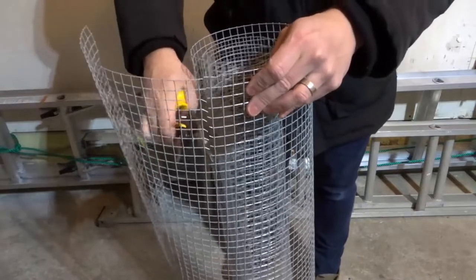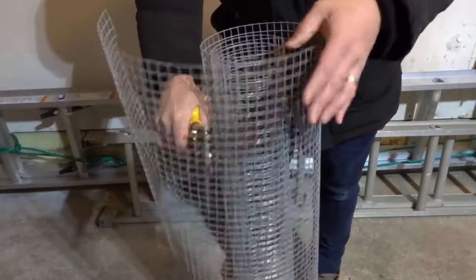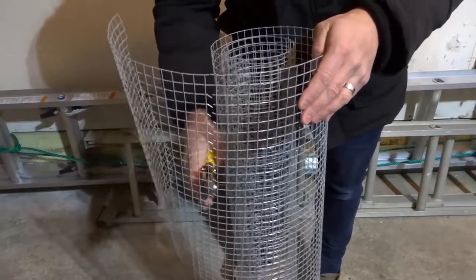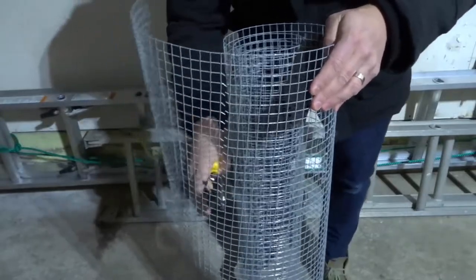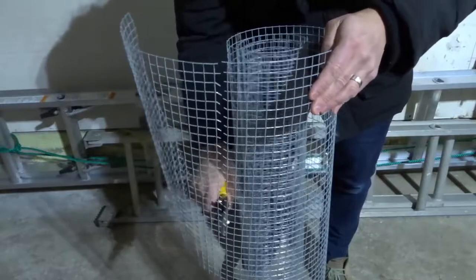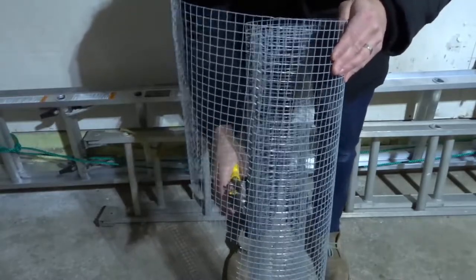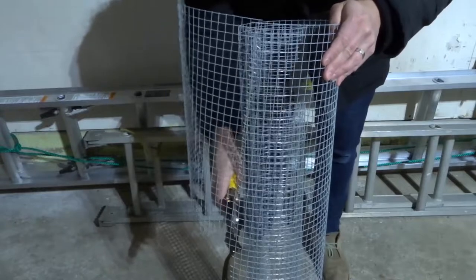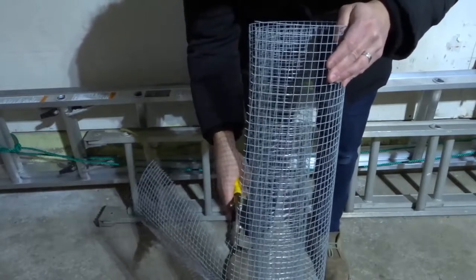Some people won't like this because it takes a while, but to be honest this is your best bet — it works flawlessly. It's very safe because when you cut metal there are always things to keep in mind regarding metal pieces flying off, but with this method you're cutting at very low impact. I apologize about the lighting — the garage door light just went off. We're just cutting slowly but surely, following our way down. The benefit of tin snips is they're designed to cut through sheet metal, so they're strong enough for this mesh. Even the thickest grid I could find at my local hardware store — I believe I got this from Home Depot — these cut through perfectly fine.